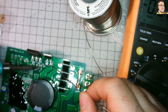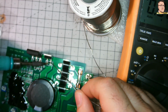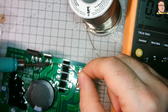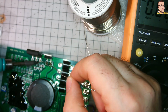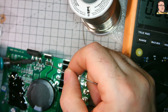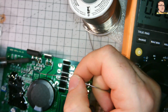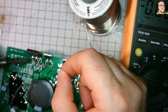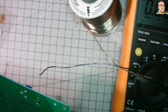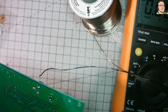As you can see, the hand solder was from the bottom side, which okay is correct, but I don't like it because it's not going through every through-hole component. The solder should leak to the other side. In some IPC standards, you need to cover a minimum of 85%. And because it's a power component, I don't like it. I just put extra solder to make sure it is joined correctly.